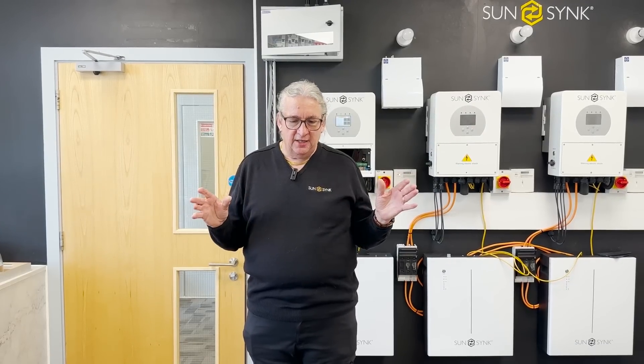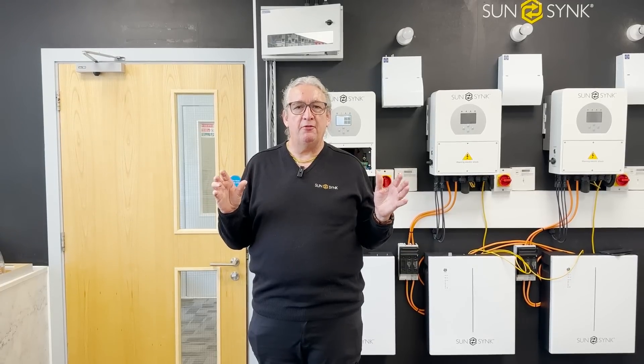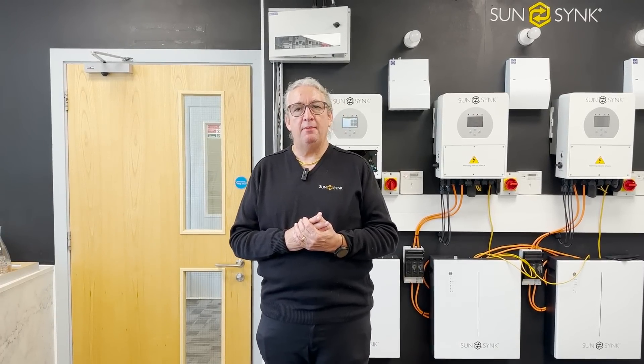Now, there's a simple setup here, and I'm going to talk about some of the pitfalls that people fall into. Do you need to use an RCD? I'll refer to RCDs as a generic term. If the cable is buried in the wall and it's unprotected, yes — you need to use a 30mA RCD.